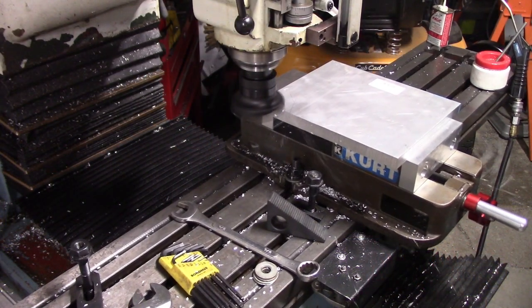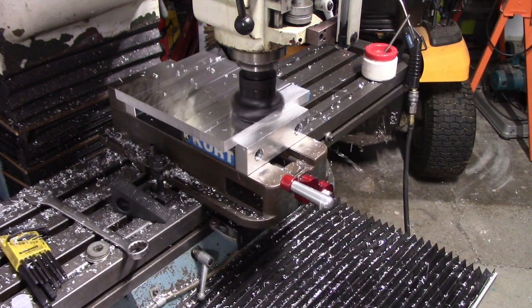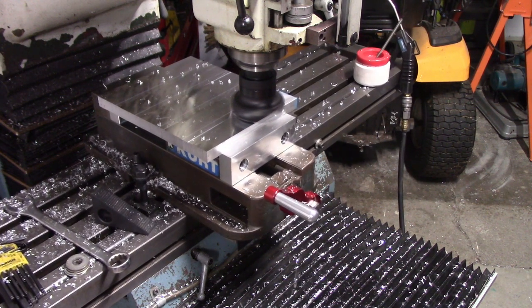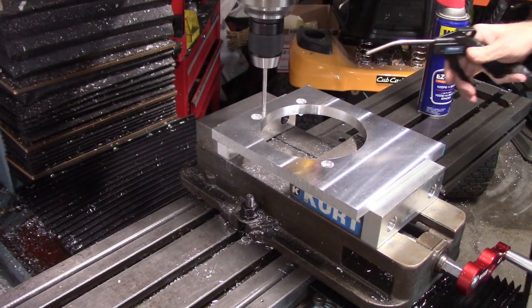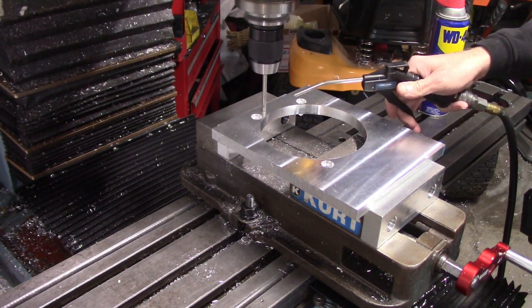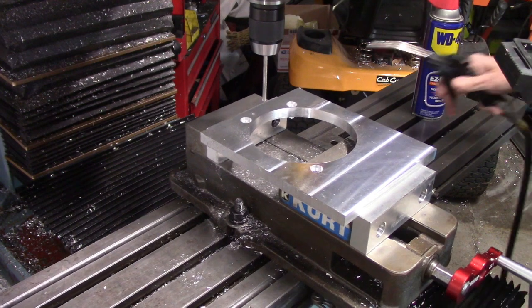The first step in making the new adapter was basically fly cutting the stock to size. Started out with 3/4 inch 6061 and fly cut it. Really, it's actually a face mill, down to 5/8. Then proceeded, I somehow lost the footage that shows the machining of the center hole and the countersinks for the 3 bolts you see to hold it to the tail housing.